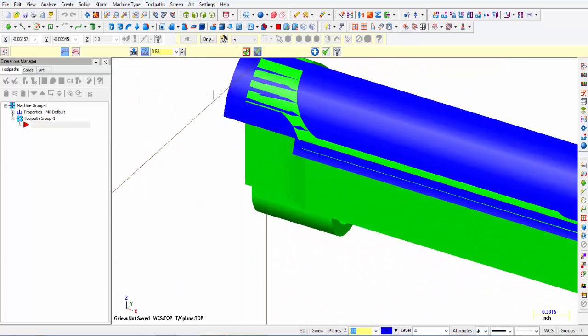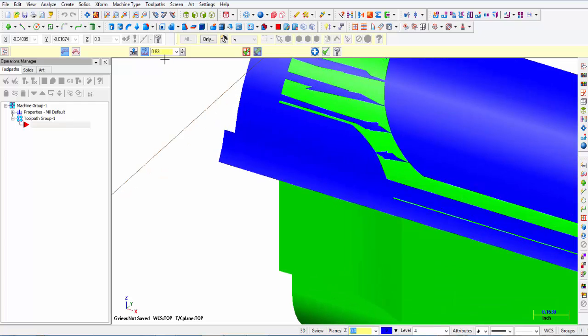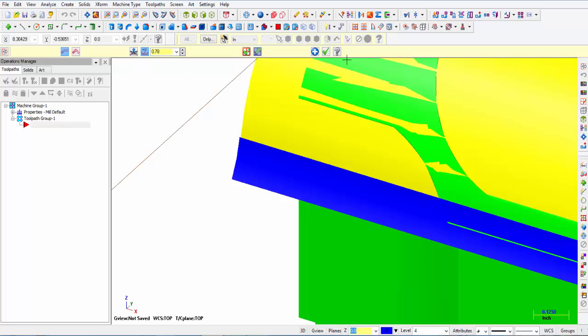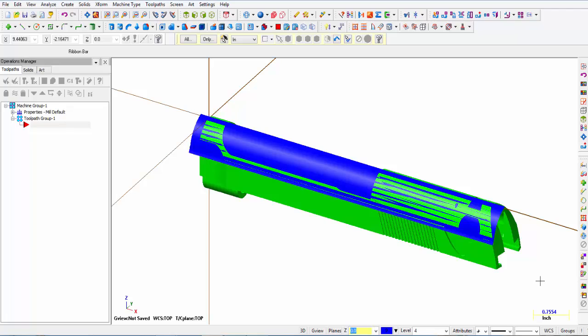We're going to hit the apply button, then click this end and let the arrow snap to that edge. You can see that 0.830 got it beyond this edge, but I'd like it a little closer — so let's try 0.790, then 0.770. A little bit more: 0.780, and that is good enough. Now we have two surfaces that are about equal length. The part is just barely bleeding through by a couple of tenths — that's all you're seeing there. We are ready to pick this surface and start machining.